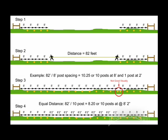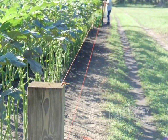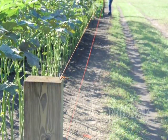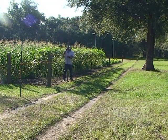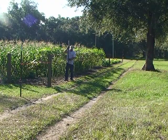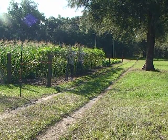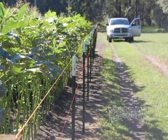This illustration will help demonstrate. At this point, I've pulled a string across the top from end post to end post. This allows you to get the proper height for your post as you're setting them so they'll be level across the top. Here you can see that I'm driving the post at the painted mark that we placed on the ground. There's a string along the side to give me the side measurement and a string across the top for the proper height. That way all the posts are uniform in the entire fence line.